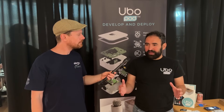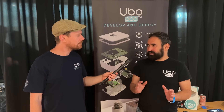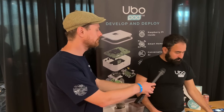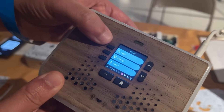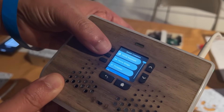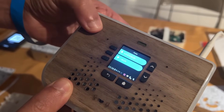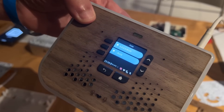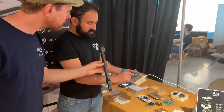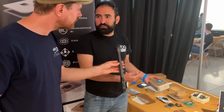OuboPod brings common user interfaces like a graphical user interface, LED ring, audio speakers and microphones for speech and voice interactions. You can run popular Raspberry Pi applications like Home Assistant, turning this into a smart home hub. In the apps section you can install and run Docker containers — for example, I'm already running Home Assistant on this thing, and it gives you the address running on port 8123, so you just go to your web browser and access the Home Assistant dashboard.